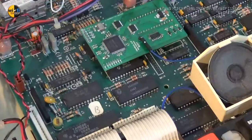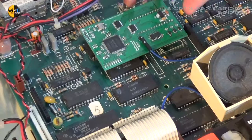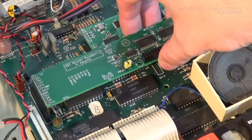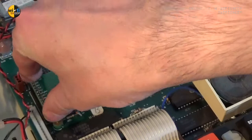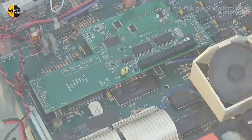And hence why we need to look at fitting a board internally. I have got the NU-LA video card fitted and that does overhang in the space for this; however, I'm hoping this will sit on top. Making sure we're actually the correct way round — and of course your computer is actually off. We'll mount that in there so we can get the pins to marry up on the other side. And there we go, no problem at all.